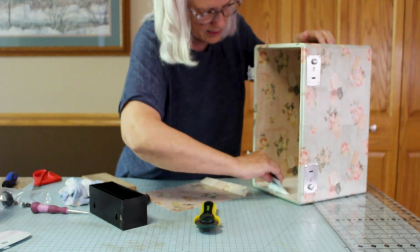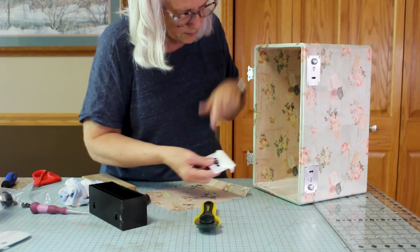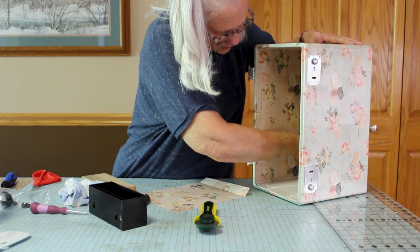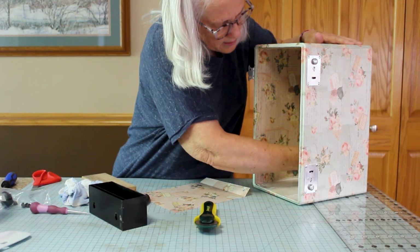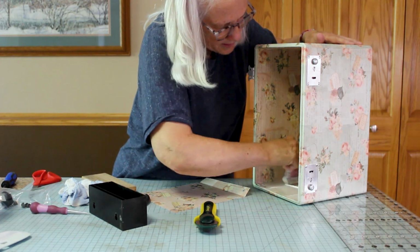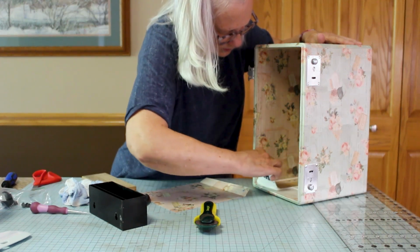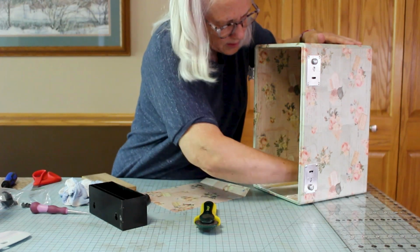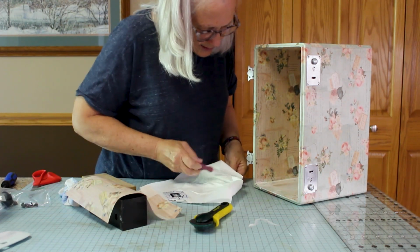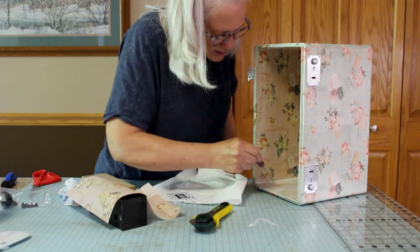And the reason that I told you to be sure and put those screws in there again is because when you put your next coating on, it fills the holes up with glue. It's just easier to find them if you cleared the way a little bit by putting the screw in a minute ago. Take the glue out of the screw holes because I got quite a bit in there. Make it a little easier to find it once I'm done.